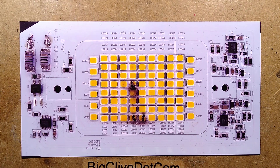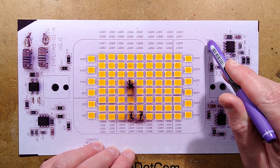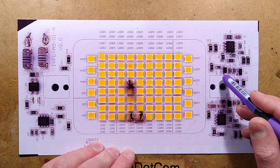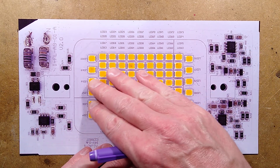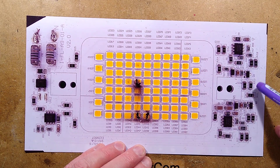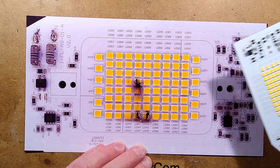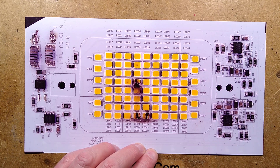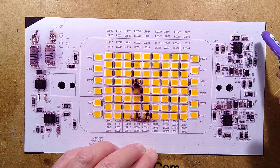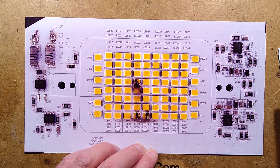There is some extra circuitry based around a couple of transistors that seem to switch in other resistors. The reason there are so many links is that it looks a busy circuit board, but it's not as busy as it looks — there are tons of links because these chips are effectively commoned, with three separate circuits driving the LEDs. Tracing the circuit is quite hard because it's an aluminium-core PCB with white solder resist, which makes tracking the traces very difficult, particularly when it's grubby and close together.